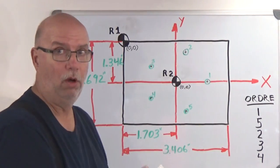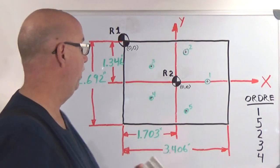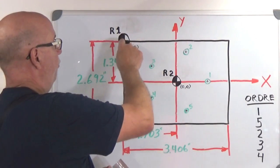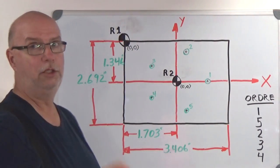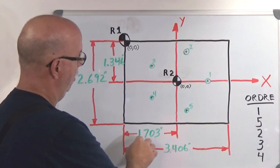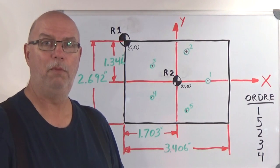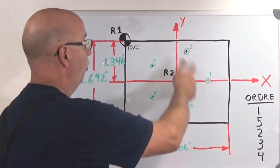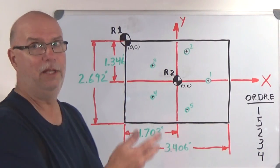The dimensions aren't important — this isn't a project, it's a demonstration. I've decided I want the bolt hole circle right in the middle of my part. So I have my original reference and we'll use the edge finder to find that. We're going to reference from corner zero-zero, move over half my height — 1 inch 346 thou — then move over in my width 1 inch 703. That puts me right on center. I'll zero my graduated collars there, and that is where we'll start from to produce our bolt hole circle using coordinates without a digital readout.